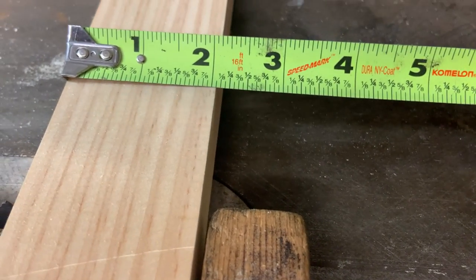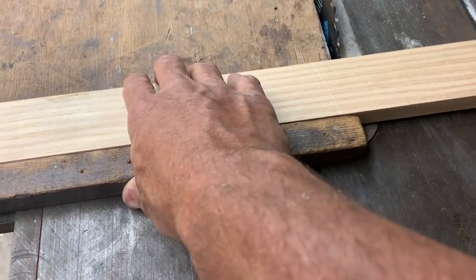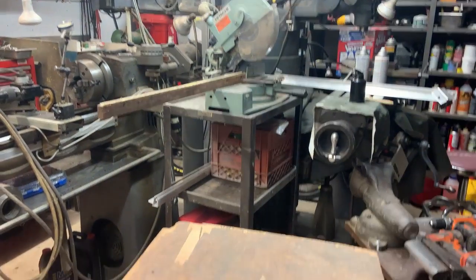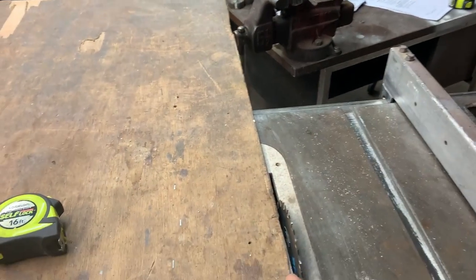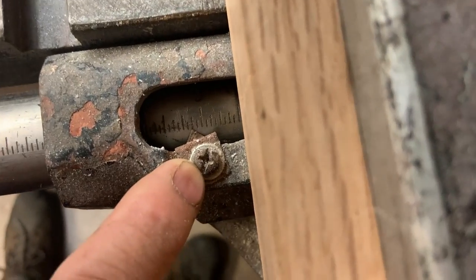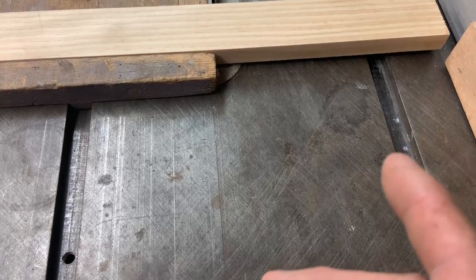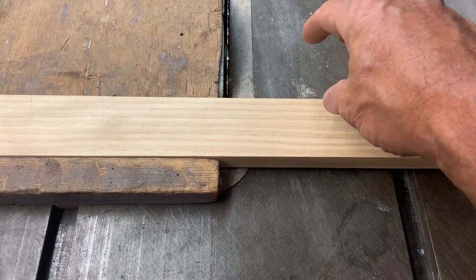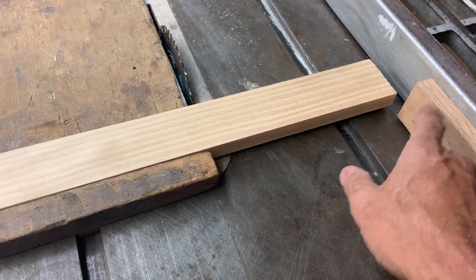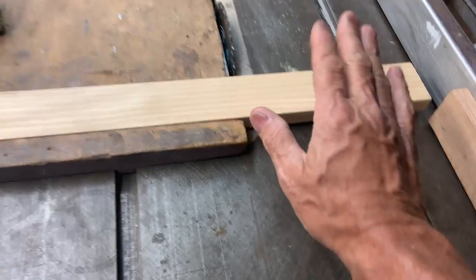That came out to about 2 and a sixteenth, which gives me a sixteenth of an inch to trim. Now we're set up with the sled so I can make a nice 90-degree cut. My miter saw would be the right tool for these cross cuts, but that blade is beat from cutting all kinds of stuff, and this setup is just so nice to work with, so we're going to use this one. I've set the fence at about 8 and seven-eighths, so we should be cutting around 8 and an eighth. I put this piece of wood here so the off-cut won't have an opportunity to turn, bind on the blade, and potentially kick back — it's just for safety. I'll be able to cut all my pieces the same length with this method, and safer.